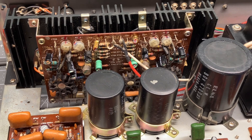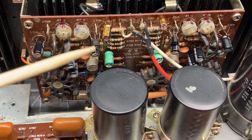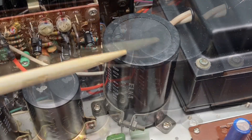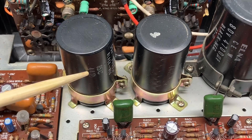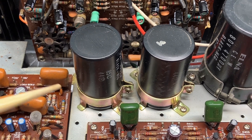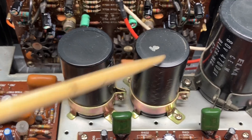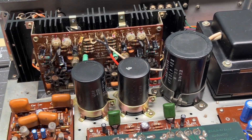This is the part of the project I've been looking forward to the most — the amplifier board — because this board has got a lot of problems. Somebody's worked on it and there's a lot of work that's just not very good. We're also going to replace these three cans. This one is your standard power can, but these two cans right here need to be a high-quality audio-grade style can because they are directly coupled to the speaker. Whatever you use for these two is going to be reflective in the sound, so remember: high-quality audio-grade capacitors.